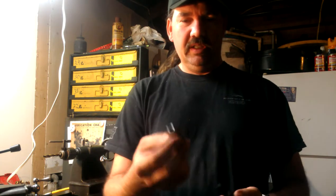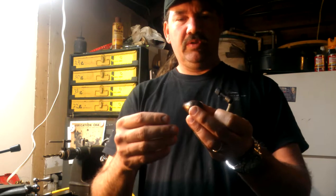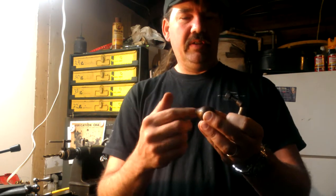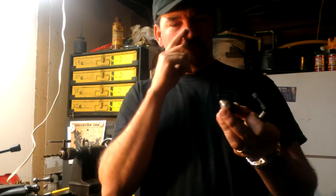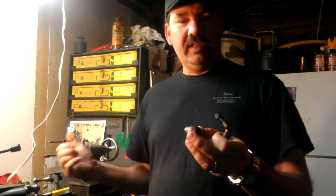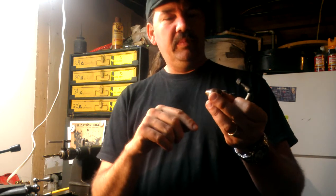What I did — I took this one here, chucked it up in the lathe and got it more or less straight, and I faced it off until I got past the threads that go into there. The core drill size went in there pretty far, and then I used that size drill bit in the tailstock here, got it aligned, and ran it a little bit deeper.